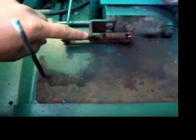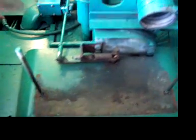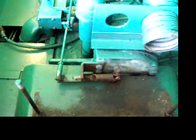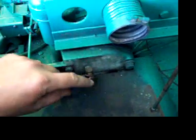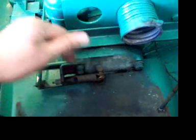We're going to run 15 kilowatts out of it. I've removed the air box so you can see all the pieces of the adjustment. We have our main speed adjusting nut with a jam nut behind it — you'll use that for your no load and full load adjustment speed. There's a sensitivity screw in here; the shorter you make that screw, the more responsive the governor will be.